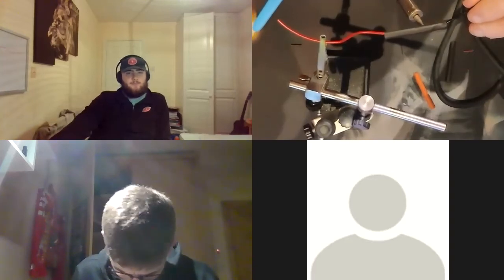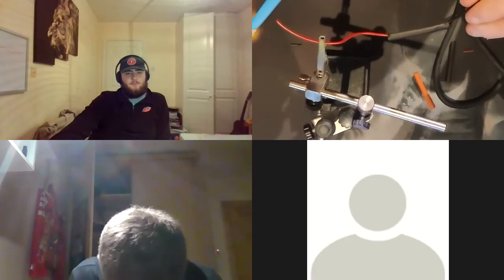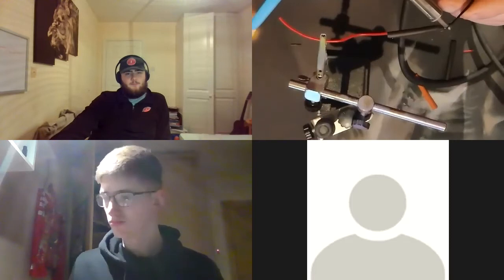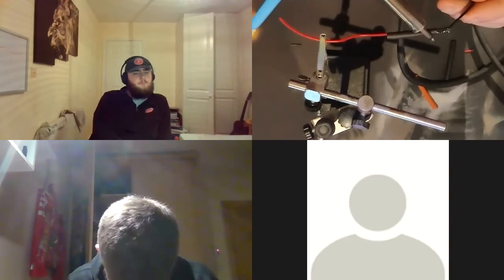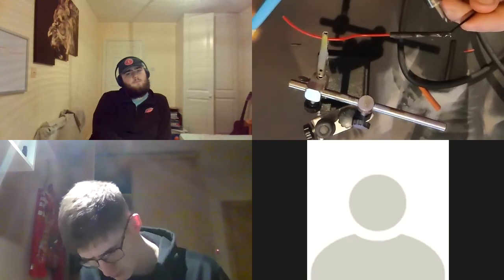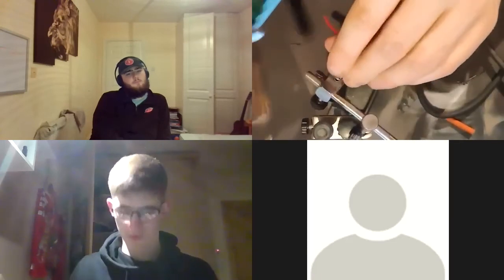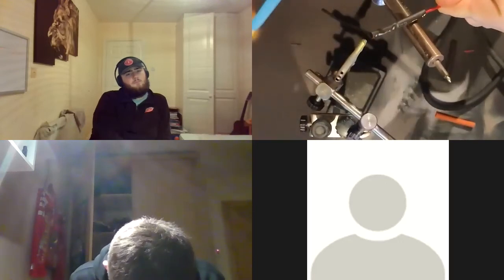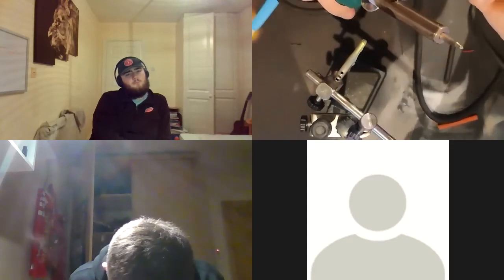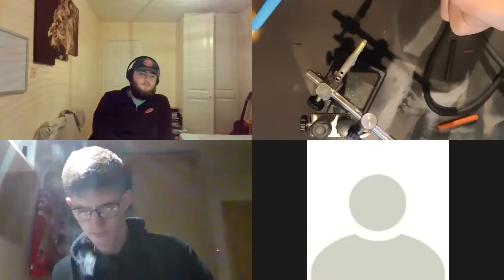Let's heat up the iron, which is working, I think. If you have a lighter or a hairdryer, use that because it's more consistent and it's not hot enough to melt the solder. So if you're doing it this way, just make sure you're careful you're not melting the solder on the inside. Oh yeah, it's definitely working. Okay, that clamp is easier to turn around. So you can use the barrel of your soldering iron to heat it. You're not actually melting anything, it's just shrinking under heat. Don't need to worry about it.